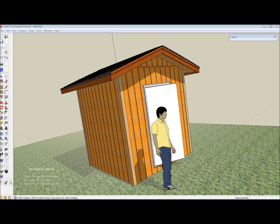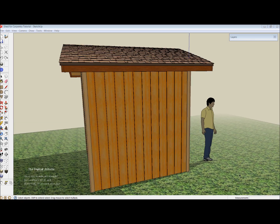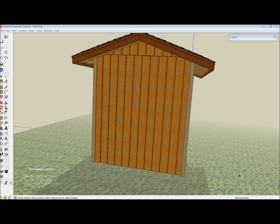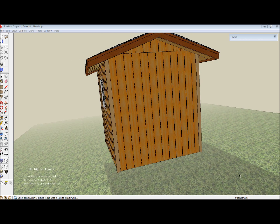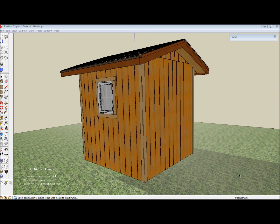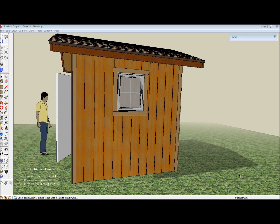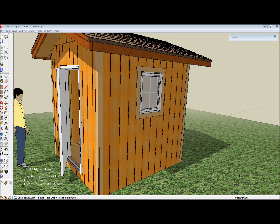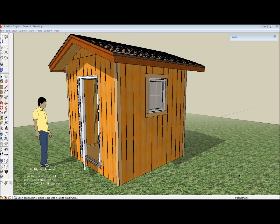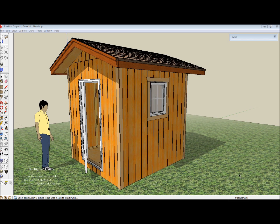As you can see, this shed is pretty basic — eight feet square. Part of the idea was to create a shed that could be covered with four-by-nine sheets of plywood siding. In some parts of the country that's called T111 — it's a fir siding, channel groove siding. To make that siding work as both the siding and the sheathing for the shed, it was important to get the layout such that the seams of the plywood siding would work with no waste or extra materials as far as studs or rips of siding go.